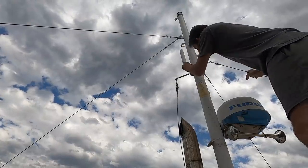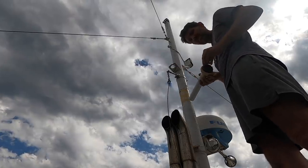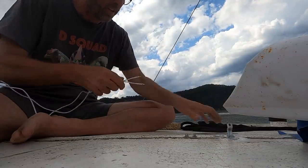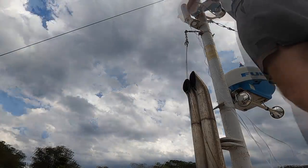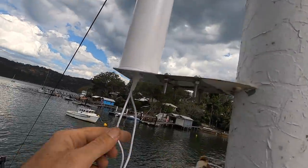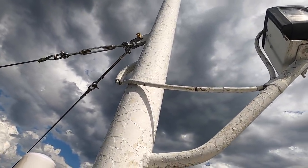Let's take this off anyway and see how these holes lined up with our bracket. Our right angle bracket is now a flat bracket. Obviously this conduit's been badly UV affected, so I'm going to cut this and use it to pull the new cables through. I'm going to try and pull these two through and some DC cables from here.